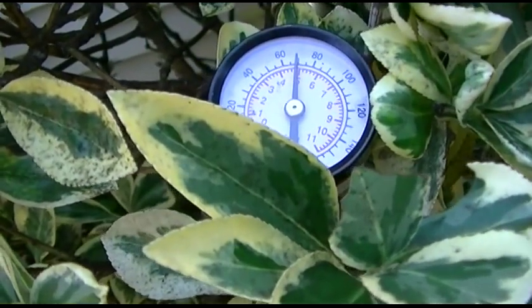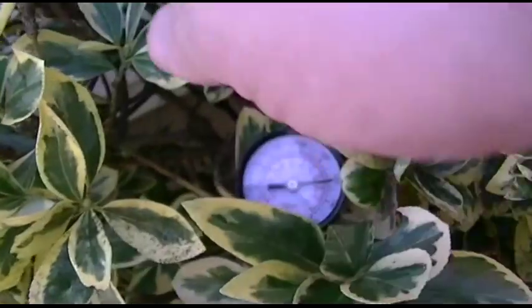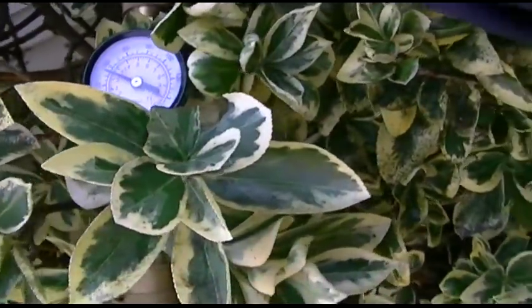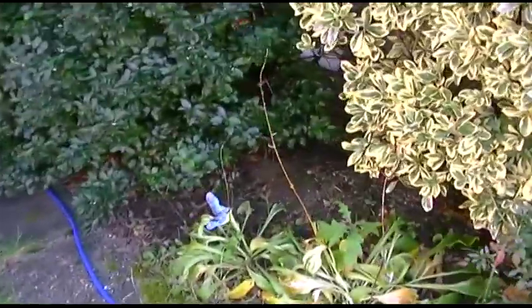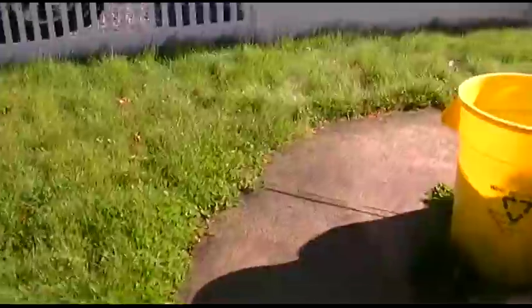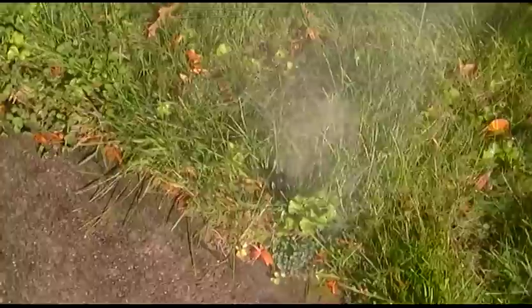Now I'm going to wait for the compressor to recover. You can see it's gauging up nicely — we're back up to pressure. So we'll hit this zone a second time. And again all we're getting is just air, and that's what you want to see. You don't want to see that mist. A little water here, which is why you blast twice. We're just getting out as much as we can here, and we'll wait until the pressure drops again.